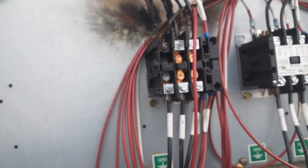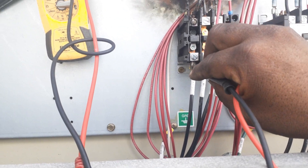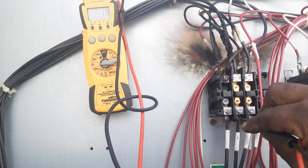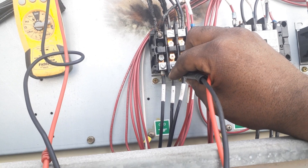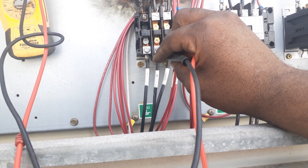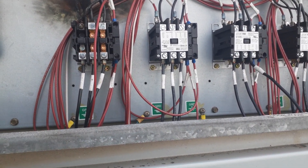This goes out to my compressor. I'm just going to ohm out those three legs right here, or I can take them off and go at the compressor if needed — just doing a quick check. Going through the compressor windings, I'm getting 1.8, 1.8, 1.8. The resistance looks pretty good. Normally all three windings are the same within a few points. I also checked from ground to each one and didn't pick up anything.